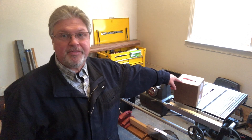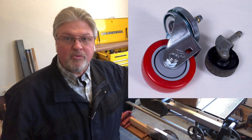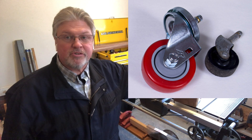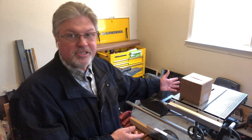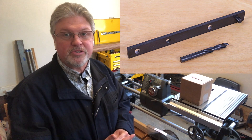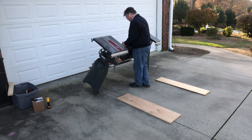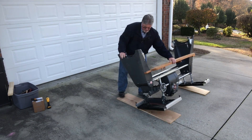Even though I have those casters on here, and I'm really pleased with them, we're going to go ahead and install this upgrade kit. It took a month to get this, and what's different about these is they're a larger diameter than was originally designed to go onto the caster assembly. So that means for these to work, we have to raise that assembly up on the leg. This kit comes with a jig to help us drill some new holes in the legs and to reposition this. I think I'm going to do this without removing the headstock, so you can see that process.